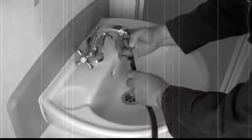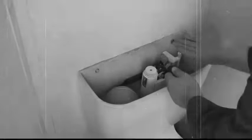The engineer would try to make a seal between their hand and the tap or faucet with the airline, and then try to blow the water in reverse from each outlet back down through the system and out of the drain valves underneath the property. Although this method has been used for years, it now has serious limitations in that it invariably means dismantling parts of the water system such as the boiler, your shower, and the toilet is usually ignored. Dismantling your system means that your property will be out of commission over the winter months until it's reassembled again.